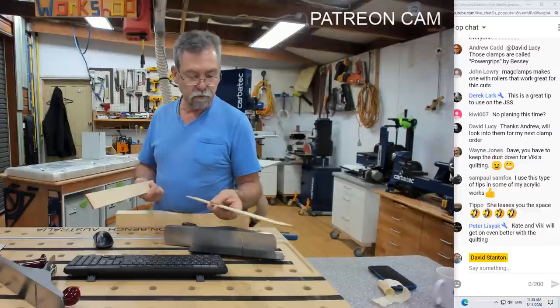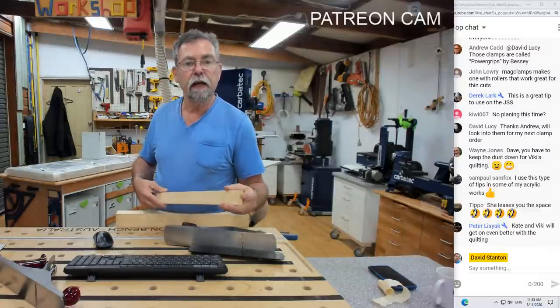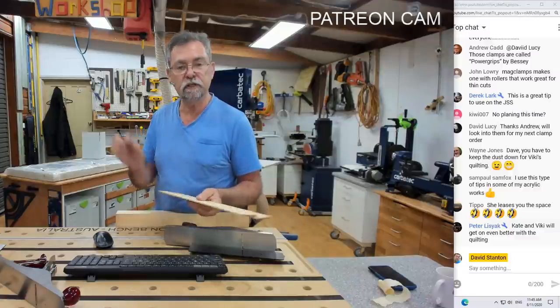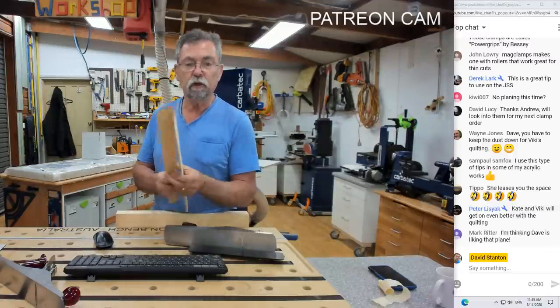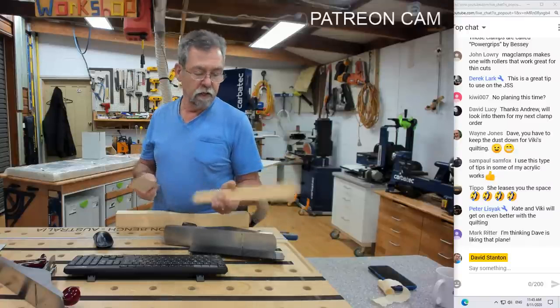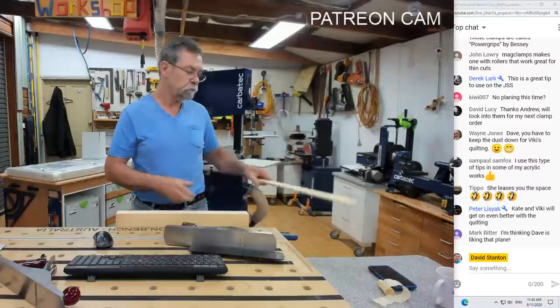Now, what would you use these for? Well, say I've got some plywood, not this thick, obviously. I could make some veneers to go across the edge, instead of using the plastic tape and glue on. So I could glue this on and then give it a very, very fine plane, maybe a sand on the outside. We've got a nice finish. This is hoop pine, if anyone's curious.